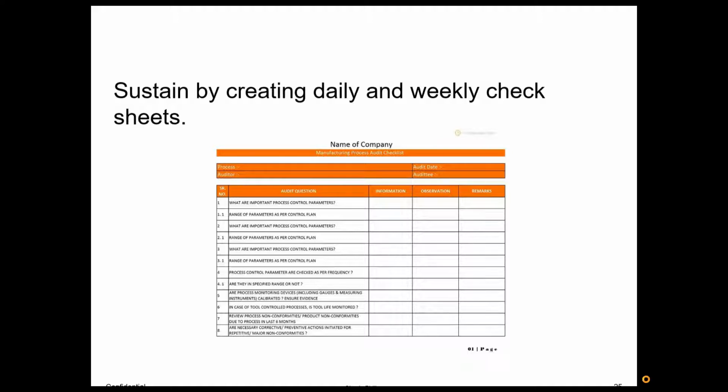I've even seen this done where the information is permanent on a whiteboard. And at the end of the day, they'll just use a dry erase marker and check off each item to show that it's done. The next morning they come in, they erase the marks, and at the end of the day, they do it all over again. From a safety perspective, it's great to have those check sheets and save them because it verifies a safety inspection, if you include items like ladder inspections and steps and good lighting and no clutter and things like that. But you decide, and I would suggest this as a living document, your 5S check sheet, that you morph day in and day out based on whatever needs you have. If all of a sudden people aren't emptying the trash, then add it to your 5S check sheet.